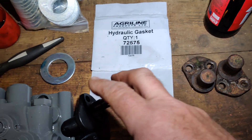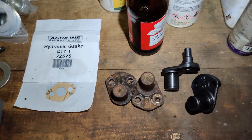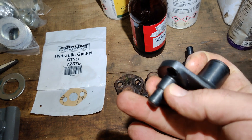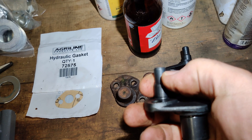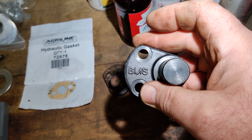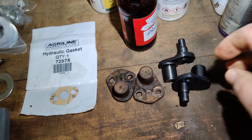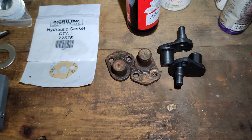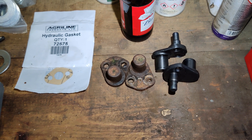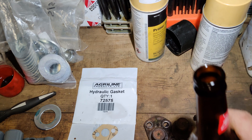So yeah, that's what happened. And if you mess around with your hydraulic blow-off pressure in your safety systems, you'll break something further down the line. So what I've had to do is order a new pair, get me gaskets, and hope that the gearbox casing is alright where those bits fit through. But whether that has wallowed out the hole inside of the pump, I don't know yet. So we may well be having to replace the pump on this too. Anyway, hopefully that was interesting to somebody. I will be getting these fitted in the next day or so, so we can see what's happened. But remember, the pressure relief valve is there for a reason — take it out and you're going to break something else. So anyway, thanks for watching, and I'll see you again next time. Bye!